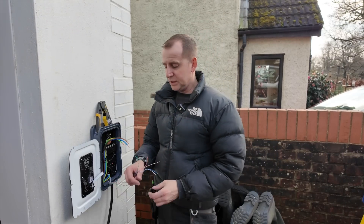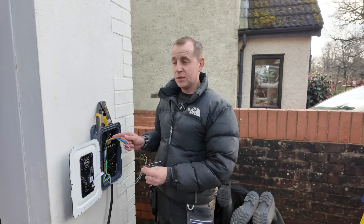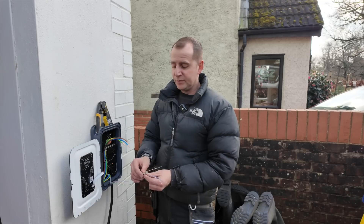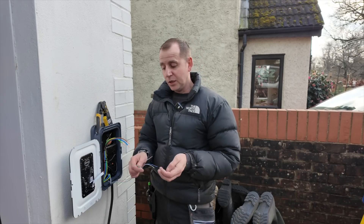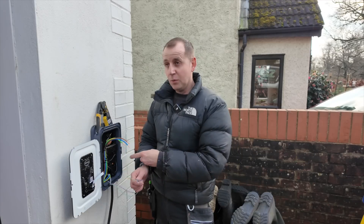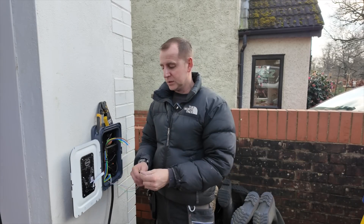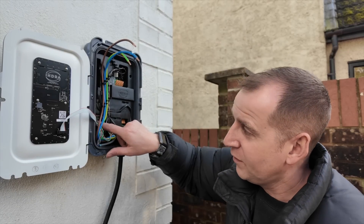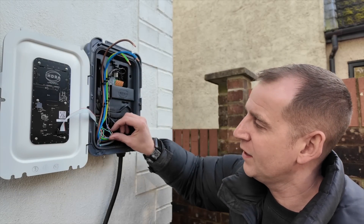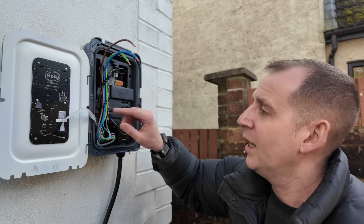What I'm doing here is using the brown and the white for the load curtailment, which leaves me with the orange, the green and the blue pairs. I'm going to keep this in order, make off my RJ45 connection with this, pop it in there. I am not a data expert. I've got the RJ45 connection just in there and I've left these nice and long because I'm too scared to cut them short in case I've done it wrong.